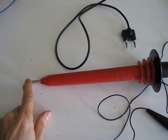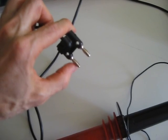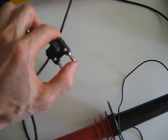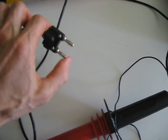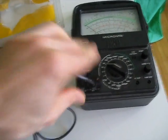This is the probe tip which you put against the high voltage point that you're measuring. It basically has two sets of wires coming out of it. One is this cable right here that has two banana plugs on the end. This banana plug is ground or common, and this one right here is positive. So this is what you measure against these two right here. And conveniently enough, this plugs into my meter just like that.